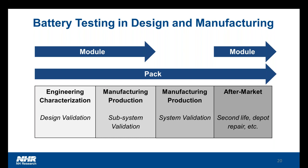In aftermarket, there's a wide range of devices and approaches for second life, for depot repair, etc. A pack may be cycled slightly to determine if there's really a problem with the battery pack before issuing a warranty repair. In a second life application, the pack may be cycled to determine if there are certain cells or modules inside that should be discarded, and then break the pack down and rebuild a new pack for a new application. That new pack would then need to be tested to make sure it's safe. For example, one of the common uses of a leaf battery pack is turning it into energy storage for RV systems.